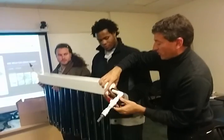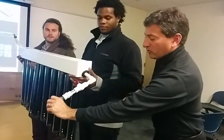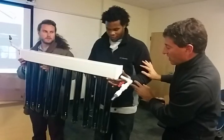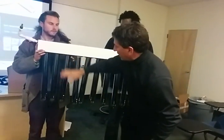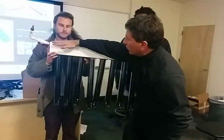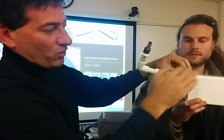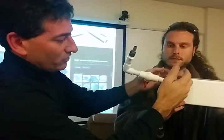We put the cold water inlet on the bottom angle on one side with the half-inch tube. You'd hook your garden hose here, and you've got your valve here so you could open it up and let the cold water in low. The cold water will then flow through the bottom part and drop down into these hollow vacuum tubes until it fills them up with water. You'd fill this up and continue filling until the whole thing was filled with cold water, with this valve here closed. This is the hot water out, and it's at the topmost part because that's where hot water will go — hot water rises and cold water falls. Once this is all filled with water and once we glue these, it will be watertight.